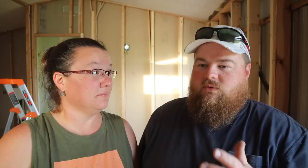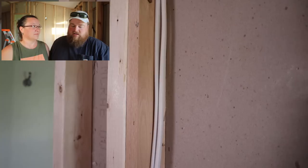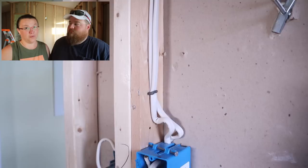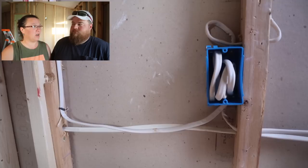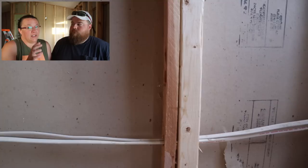We're at the stopping point for today and I feel pretty good about what we got done. We got all the walls in here prepped for drywall, did a lot of work with electrical, cleaned up a lot of the wires, ran new wires, fixed the frays, and installed our boxes. For those who don't know, whenever they put in electric in mobile homes, all of the outlets are floating — meaning they are not attached to a stud. So anytime we redo a room we have to put in electric boxes. We've added residential boxes to most of it, but they too have been floating — that's just the way mobile homes, at least of this vintage, are built. This is a 1988 model.